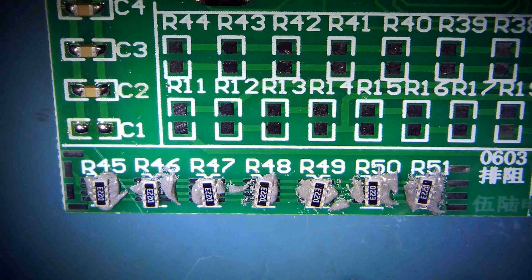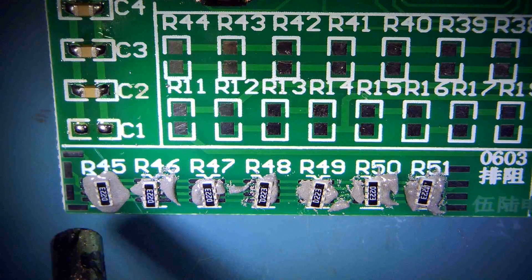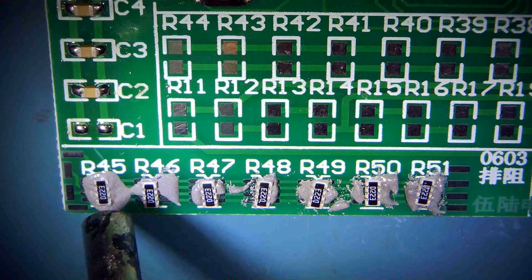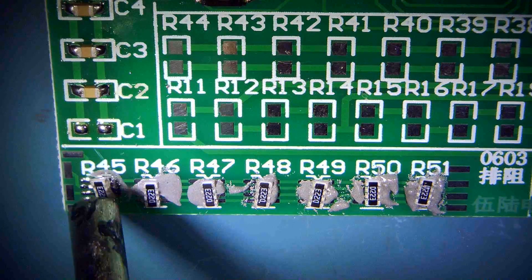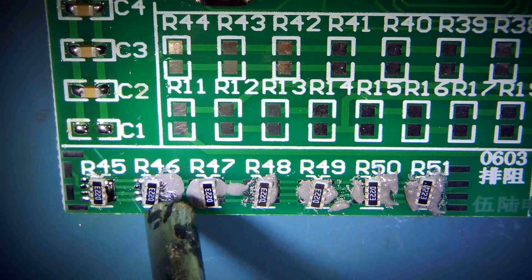This thing I doubt here has too much flux, but we will see what's going to happen. Now we use a hot air gun to solder them. I will start here in the corner. First I'll wait for my hot air gun to have the right temperature — we are at 445 now. And then we're going to start here on this one and get close and hot until it turns to solder.